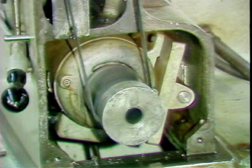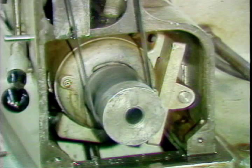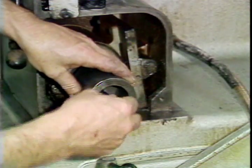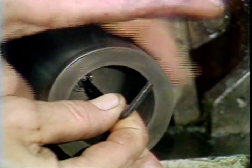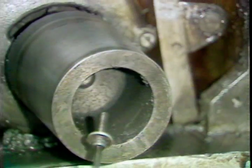Depending on the age of your machine, there are 2 different styles of B or bottom position pulleys. On older machines, all the pulleys would have keys, and the pulleys would all be removed from the straightener motor shaft. To remove the older style pulley, loosen this bolt on the end of the motor shaft. Remove the bolt and washer. Slide the pulley off the shaft.